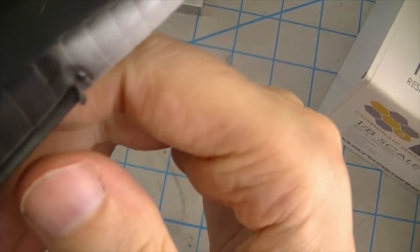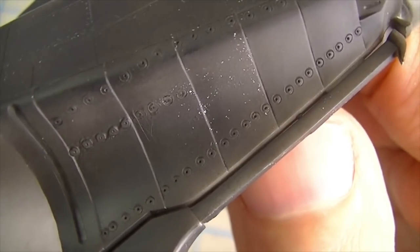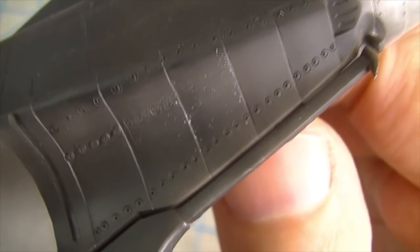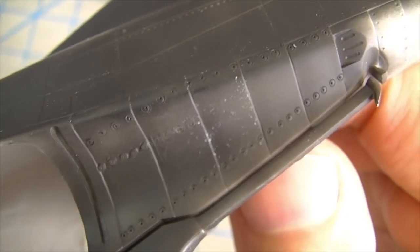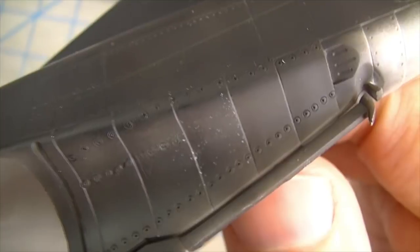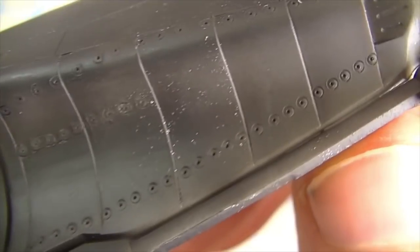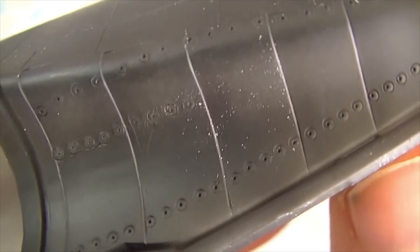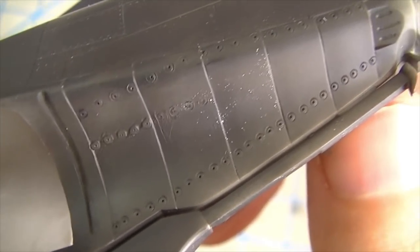But what I did is I took a piece of brass tubing and I put a sewing needle that fit tightly in the middle inside of it, in the inside diameter, and glued it in there so it couldn't flex, and left just a tiny little titty of it sticking out of the end of the brass tubing, which I also chamfered to make it sharp. And you can see that now that little titty sticking out of there basically causes the punch to be self-centering. So these aren't perfect, but they aren't bad at all. I'm pretty pleased with them.